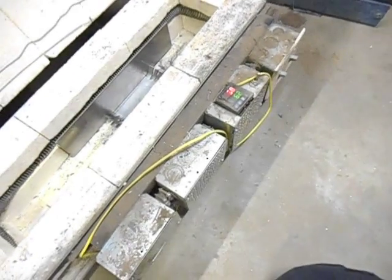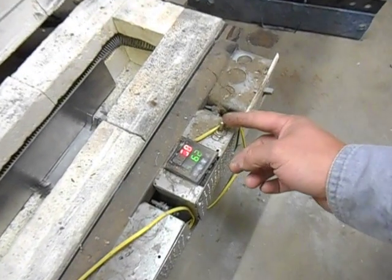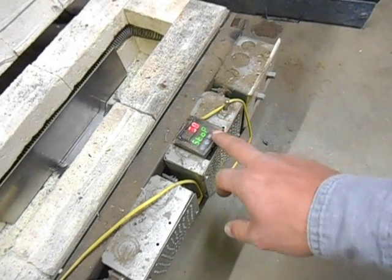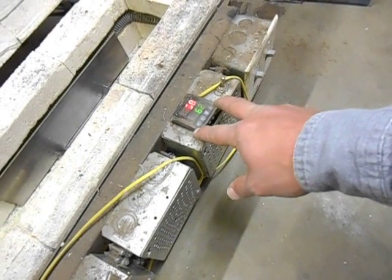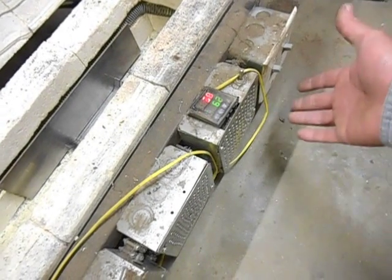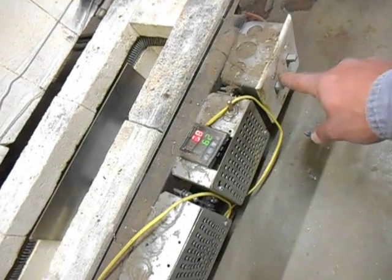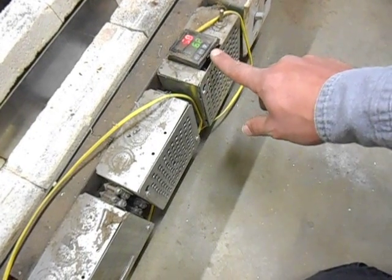I could not find an automatic door opening switch, so I've got this toggle switch right here that, if I remember right, cuts power. It cuts the signal coming out of the PID controller going to the SSRs. You've got a PID controller here, and this runs on 220. So you have 2 120 legs coming in, and if I remember right, I'm kind of weak on wiring, those lines come in, and I just have a switch for either leg. Those lines come in, and I take some power off one of them to run the PID controller.